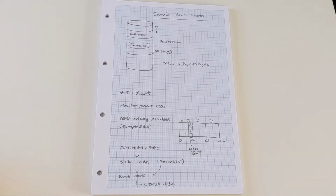But quickly people realised, seems to be the story of the IT world, that the 64K full address space that was there wasn't enough. So that's where the phantom line came into play. Now, Cromemco didn't use that. They used what they called bank select, which was the output to a port 40.